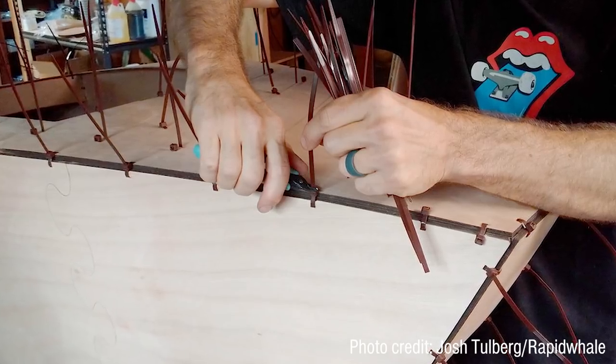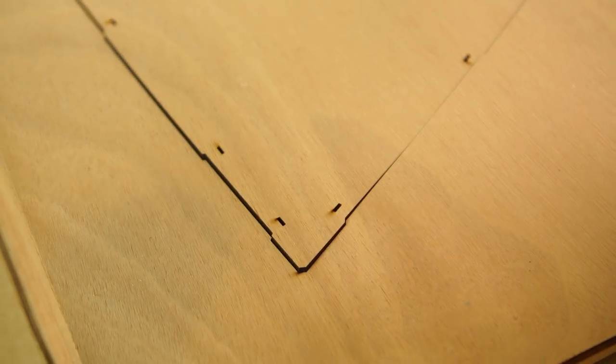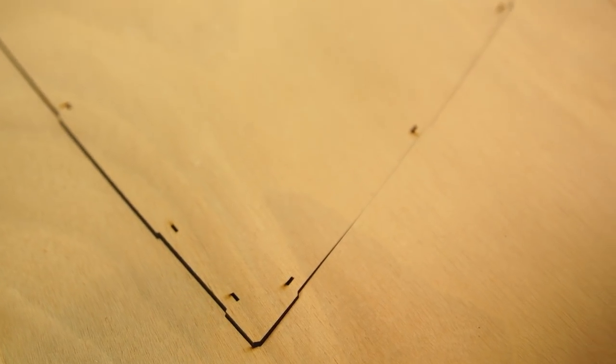That's insane because, like you said, this started off as flat sheets. We've built model boats before where you have to heat your plywood, wet it, and put it around a jig to get that curve, and glue each piece together. But with stitch-and-glue, there's no metal frame — you're literally just zip-tying the panels together. When I saw the technique, I knew I had to build a boat.